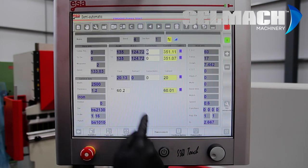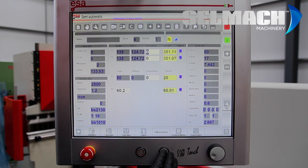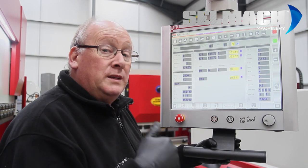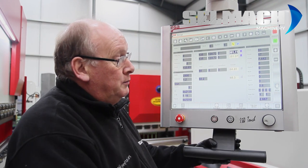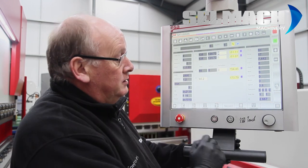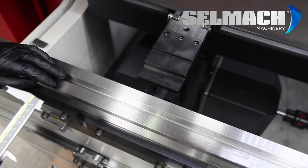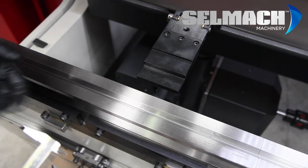Pick a figure — let's say 50mm — set to semi-automatic and press run. Now we've adjusted the parameter, we need to check it, but we need to re-reference first. Press manual as normal and press start. You'll see the back gauge R and X are now re-datuming. Once they've re-datumed, we can bring it in to 50mm. It may take several times, but let's check it and adjust again if needed.